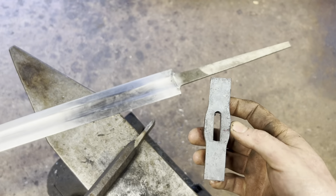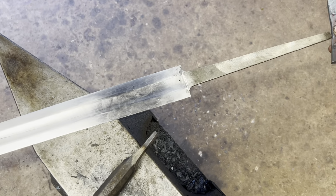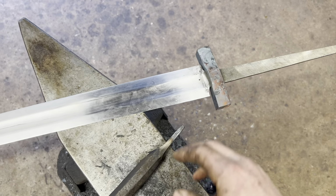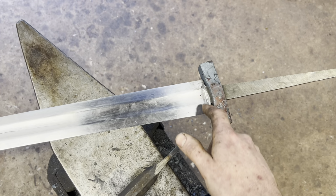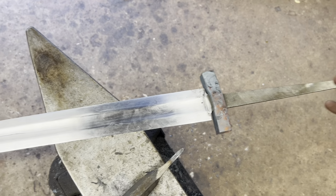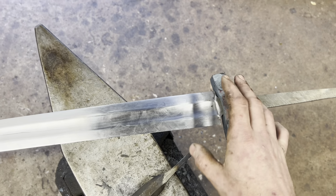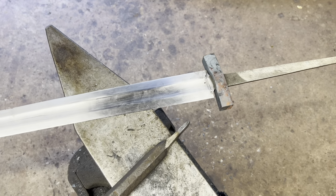So we got our initial rectangular hole punched into the piece that's going to become our guard. It's fitting the sword pretty stinking well. So the next thing we need to do is make another punch that has the same shape as the bottom of the sword, and then punch that partially through the guard so that whenever we assemble the sword, the shoulders of the tang and everything are going to be recessed into the guard, because that'll just look much, much nicer. So that's what's happening now.